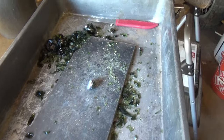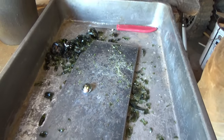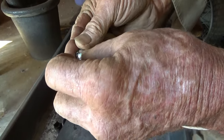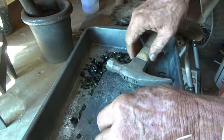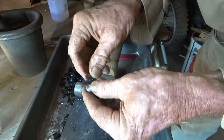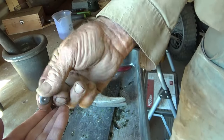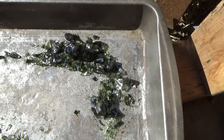We got really good separation from the look of things, and one very cute little button that we are going to clean and weigh and find out where we are. Go ahead and use the tweezers and dunk it in the water — it may crack that slag right off. Let's go find out what it weighs. That is our slag — it's going to be weighed in a couple of minutes and all the information put in the records so we can do a mass balance.